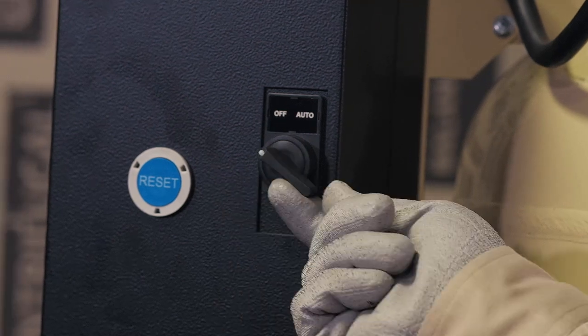The first step is to check the pressure gauge to determine if your unit should be cycling. This particular unit cycles between 135 and 175 psi. Let the compressor cycle up to 175 psi and watch for it to shut off at that point. If it doesn't shut off at 175 psi, try to turn the unit off by switching the off-auto switch on the starter box to the off position.